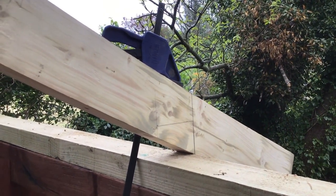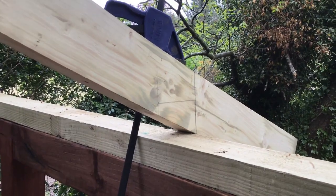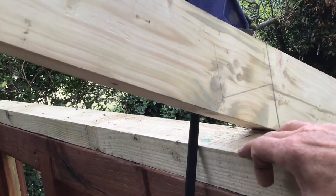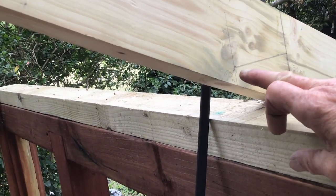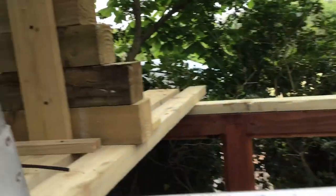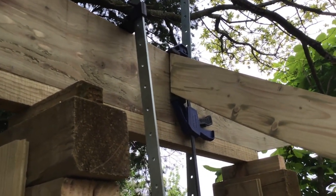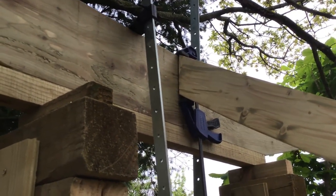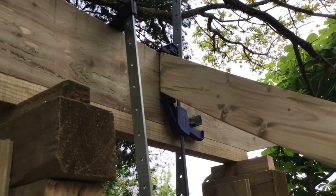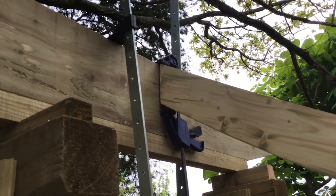I've marked out the lower part of the rafter — I'm going to do 60mm up by 100mm because it's a 100mm beam. From that line is 60mm, exactly the same on both sides. That little 20mm notch, when cut out, will rest just behind the beam to stop the rafter moving outwards, and the rafter itself will drop down 60mm. With it slid into position you should see a good 30mm of the ridge once the slate is on and the underlying board, because that will take up about 30mm. So: 60mm drop, 20mm board, followed by a 25–30mm slate, means you should see 30mm sticking out the top.